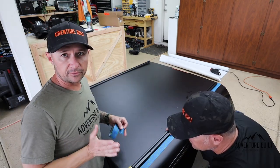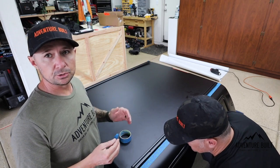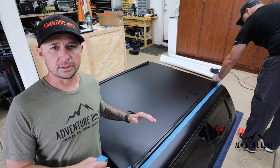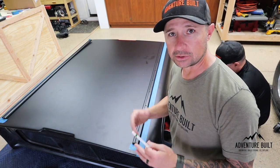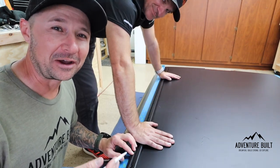We initially marked out three inches from the front to center them forward and back, but that seemed a little too far, so we went with two and a half inches. After you get them where you want them, take a step back and make sure it looks good — if it doesn't look good to your eye on the ground, it's probably not going to look good up in the air. The directions call for you to sink the first two holes and then skip every other hole after that. But the name of the game is to make sure these don't move and stay stable — no big wobble. Make sure they're parallel at all costs. Trevor's going to hold down the rail and I'm going to mark the holes we're going to drill, then we'll pull it off, drill the pilots, and then drill the regulars. There's also a silicone washer process we have to do.